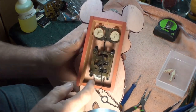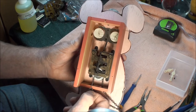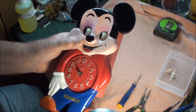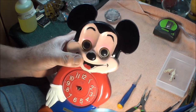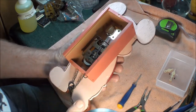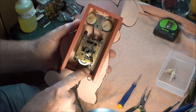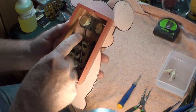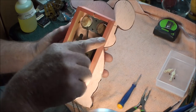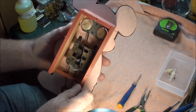And that's what the works look like. The pendulum also operates the eyes moving back and forth. The next thing we have is four Phillips screws in here, and as we take the works out, this wire comes down and jerks back up — it goes through the hole in the pendulum here — so you want to be careful with that.